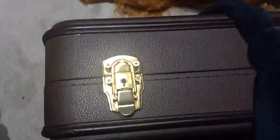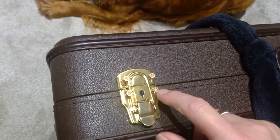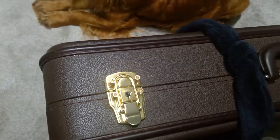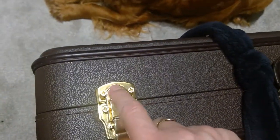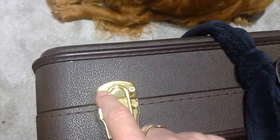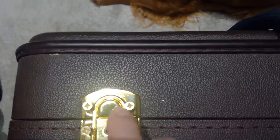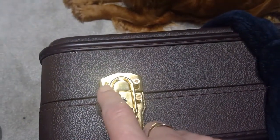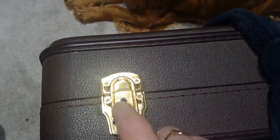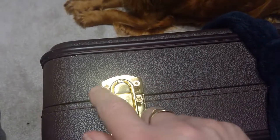Okay, so I have drilled the holes and I've just slightly screwed in the first ones, because obviously if you pull this up it's going to undo it all. Now the other thing about the lock that I've chosen is, if you try and screw these down with this piece down, they're obviously going to catch on the edges. So the best thing to do is put your screws in place and then take out the two top ones and basically unclip it, and then put the screws back in and tighten them up, which I'm going to do now.